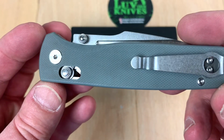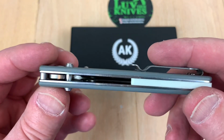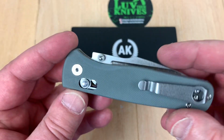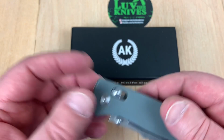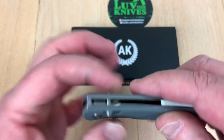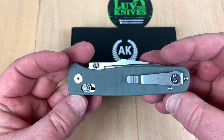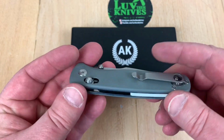These Omega Spring knives are not my favorite to disassemble, because if they've got a spring on both sides, which, yes, they do, then you've got to disassemble the spring on both sides to push this through, because it comes and it opens up in here. So you can take this piston all the way out and then separate the halves, which will at least take one side off and you can see the setup.